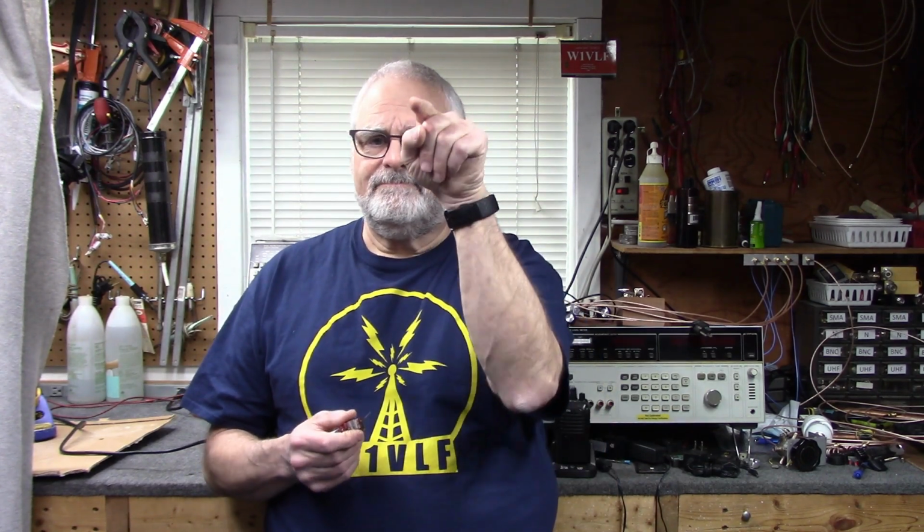Small E-field probes for me don't work because of that big station that's right down the road. I always have overload. So this allows you to bring the antenna right in, nothing in the way. If you want to put up a low pass filter in there and roll off the high end band, there's no DC going out, there's nothing.